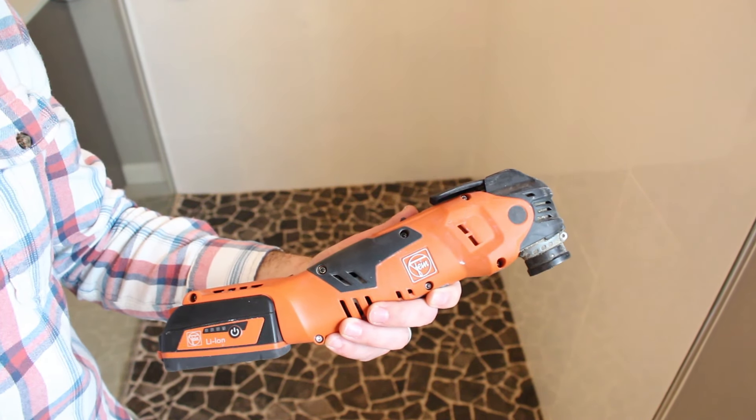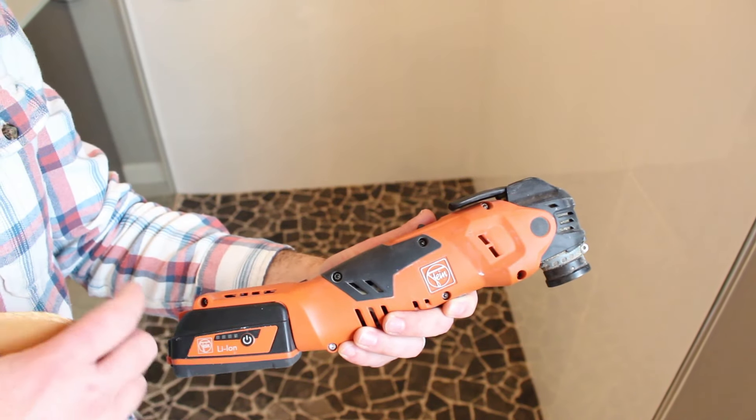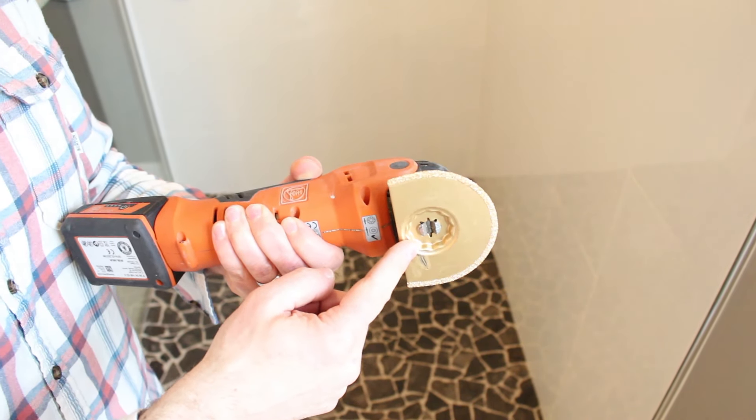Now, what can you do if you need to remove most of the grout on your shower floor or wall? I highly recommend that you get an oscillating multi-tool like this one — it's cordless, and I'll put a link in the description. You should also get a carbide attachment for your multi-tool; it simply clicks into the tool and you use it to remove the grout. In a shower, be very careful not to go down too far into the shower pan because you will ruin the waterproofing underneath. Only go down about an eighth of an inch — you may only need about a sixteenth of an inch — because ruining the waterproofing in the shower pan or wall would be a serious problem.